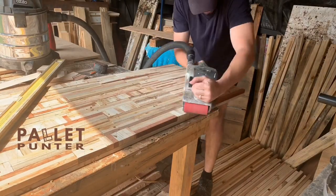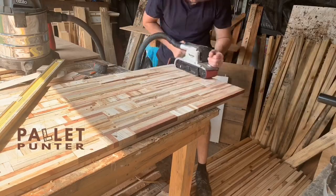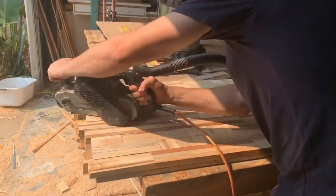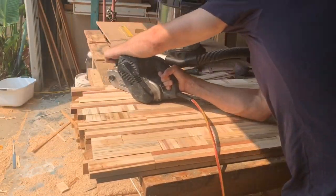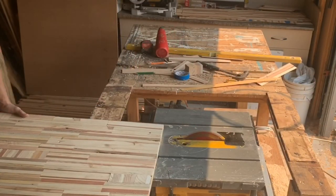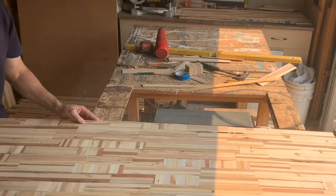It's time to clean up the top. I use a pretty heavy-duty belt sander with 40-grit sandpaper. I'll also have my level out and check that I'm not getting too carried away, because in the past I've actually sanded away too much material and ended up with a few depressions. So I just take my time now to make sure I end up with a nice flat surface.